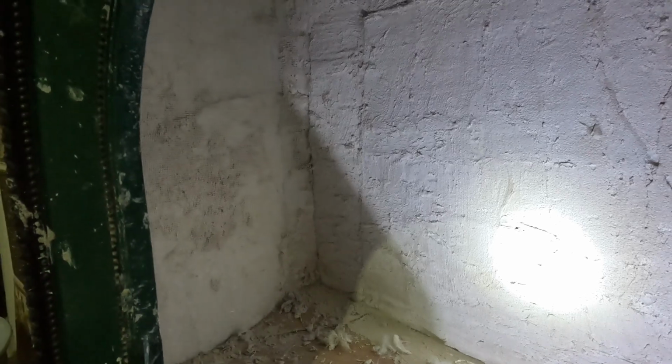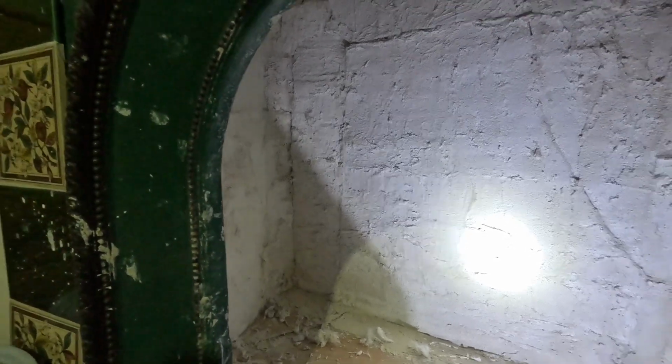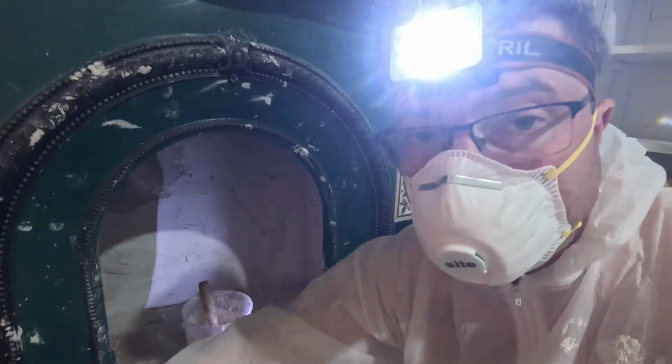Over here, where I originally did the plaster that didn't work, the aerogel blanket slightly delaminated, and so the adhesive didn't actually stick onto it very well, so then I put some glass fiber mesh on it instead. So far it's looking messy. In principle it should work, but I'm not fully convinced that it's all going to work. We'll see what happens. Scrub it off a little bit with a metal brush, not too much because it just meant the adhesive came off.